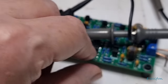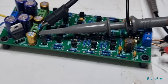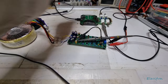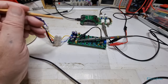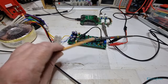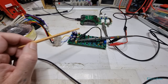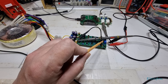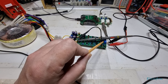Just to speed up the video — this is the ground going in, this is the signal going in, and we're using the Analog Discovery open-ended connection. We don't need any attenuation or anything because we're just measuring. I've made up some cables for doing other measurements but for now we'll show you the intermodulation distortion. We're using the JRC — to be honest I don't know if it's a genuine JRC 5532 these days, you can't really tell.